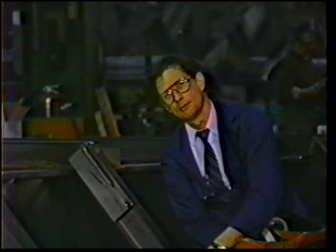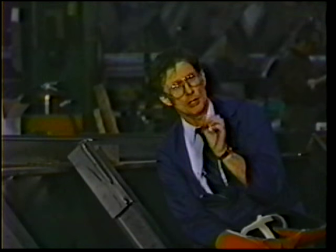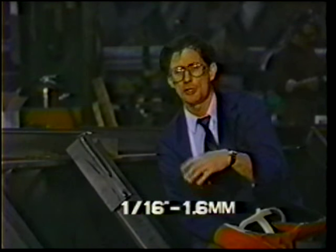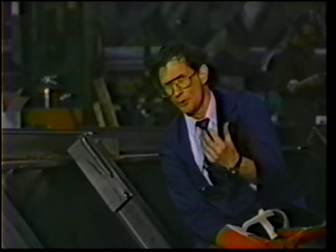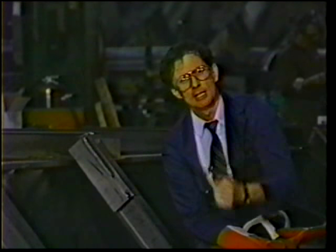When you're welding on an application such as this, where it's just over an eighth of an inch and you want to put a nice bead without spatter, you obviously need more heat. Using now 75 or 80 argon and 20% CO2 is fine for an application like this. But if you constantly weld in a shop and where you're welding on sheet metals and you never go above 16th of an inch, then it's wise to use maybe 8 to 10% CO2. After all, when you're welding sheet metals, the object is not to burn through. And if we can reduce the heat just a little bit by reducing the reactive part of the gas mix, then it makes it a little easier.